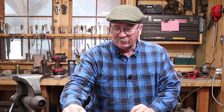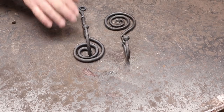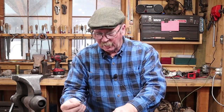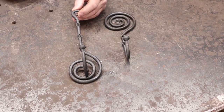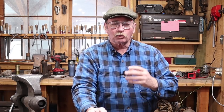People would be really interested in that. Looking at it now that it's cool, I think we could have done a little bit better job right through here so that wasn't so tight. And if I were making these for sale, I might make a little scroll form so I can get them all even every time — don't know if it's worth it for one or two, but something to consider. I always make sure that I provide appropriate color-matched screws for these things. These are slotted round head wood screws — you could use flat head. I think slotted heads always look better than Phillips, but I know a lot of people don't like messing with slotted heads. Just make sure they match. I've done a video on how to treat screws so that you can get screws that match your ironwork — I'll link to that video right up here. Including the right hardware with your project really makes a difference; people put zinc-plated hardware on with ironwork and it's really kind of distracting, so providing the hardware for your customers is really a good idea.